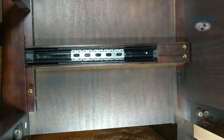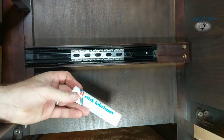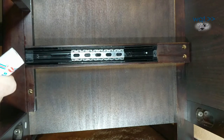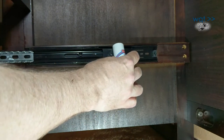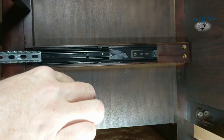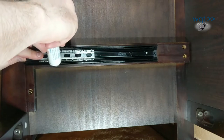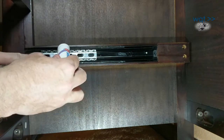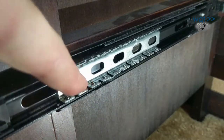When assembling or reassembling furniture with drawers, it's important to make sure the slides are properly lubricated. Here we have metal slides with ball bearings and are using a modern silicone-based lubricant. Older types of lubricants, sometimes still in use, include soft waxes such as beeswax or paraffin. The important thing is not to use a petroleum oil or grease, as these can impart an offensive odor to whatever is stored in the cabinet and can also collect dirt and grime that foul the slides. Additionally, they may shed bits and pieces of grime that can contaminate whatever is stored in the dresser.